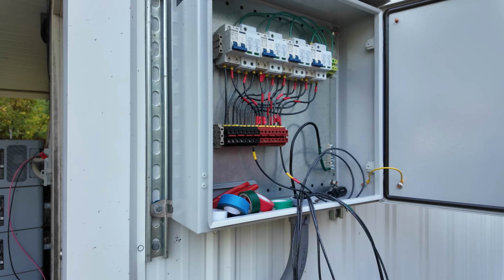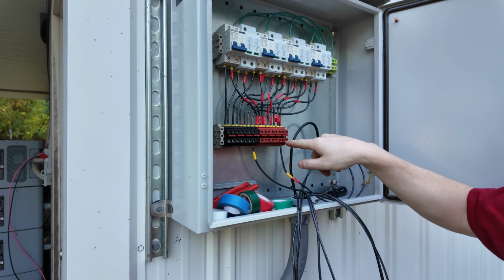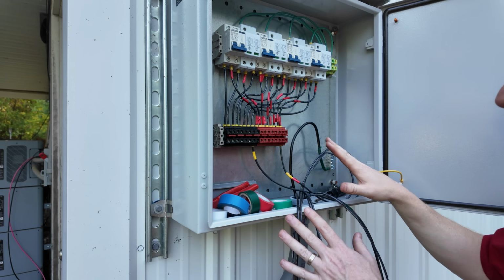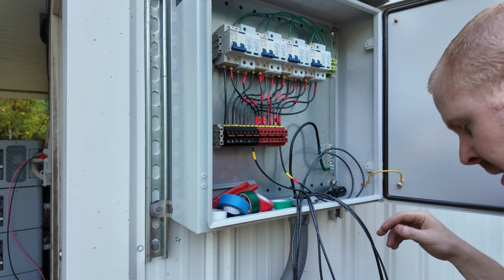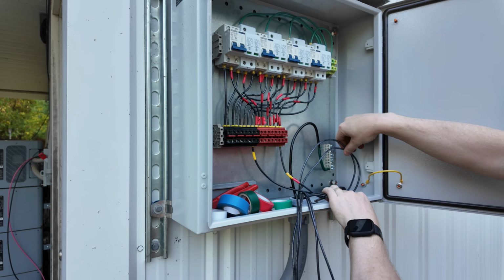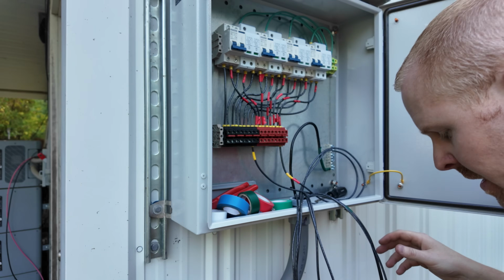Yikes. All right, so I've already landed the ground line that goes back into the house, as well as my new array lines that go back into the house, because I knew which ones those were. And I know that with those new lines, I need to be able to push back into the house as much as I can, because I'm a little short on the inside. So if I can give myself a service loop in here for any adjustments I need to do later, and then be able to pull the rest back into the house, that's going to save me a lot.